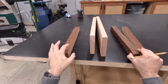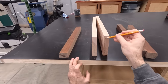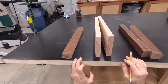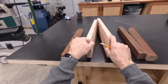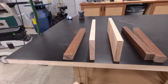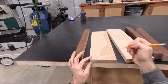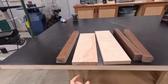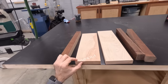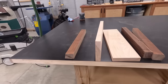When we look at these hickory boards, this is just typical flat-sawn stock — normally what you would see with most material. But I would like to do the same thing and orient the grain vertically. If I rip this into strips, maybe we'll get three pieces out of each one — one, two, three. And then once that's cut, I could flip it 90 degrees and I'll have that vertical grain orientation that I want.